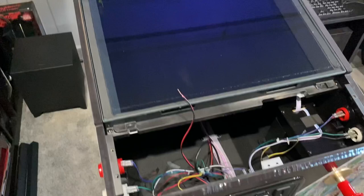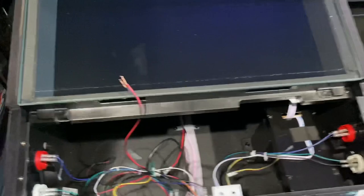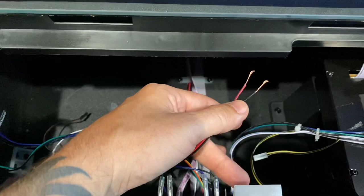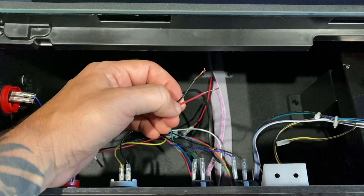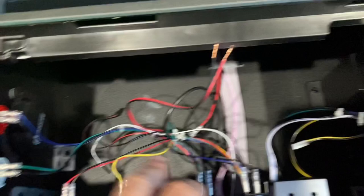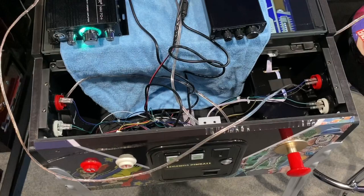I'm not going to go over how to disassemble the control panel again, but get to the point where you find the original wire that goes to the exciters — either on the arcade control panel or the original deck the unit supplies. It'll be a wire that leads to the exciters. The stock exciters are wired in series, completely different from how I'm going to wire them going forward. You can see the Daytons in the position where I placed them — hard to see the one on the right, but it's down there right below the flipper, same thing on the left side.